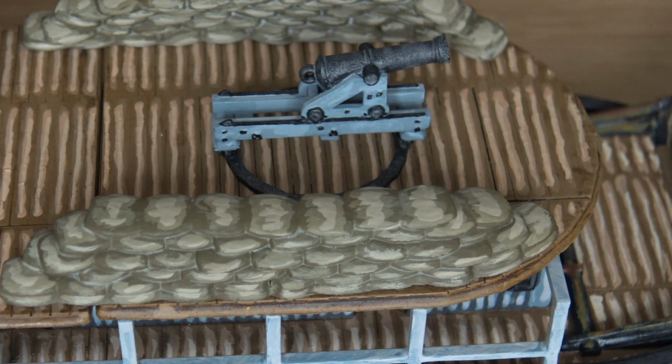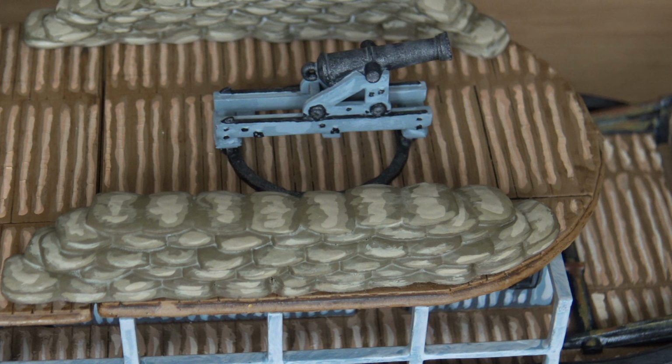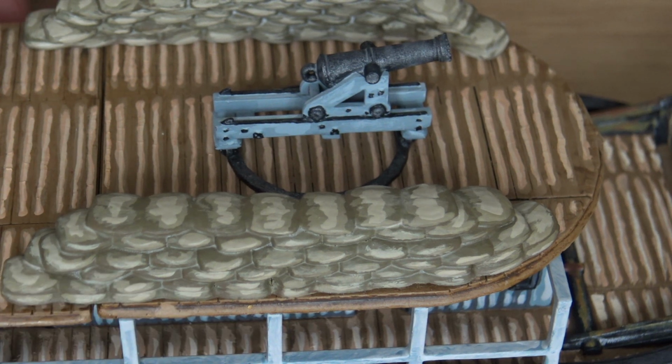And the supports themselves you break off before you do the final curing of the resin, so that they're still pliable and they will come away really easily. You can take them off just by brushing your thumb across them. So that's what I found is a much easier way of doing it.